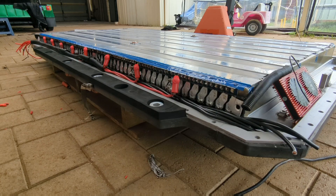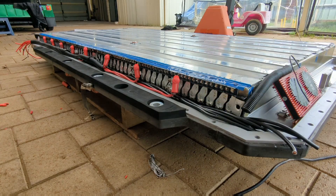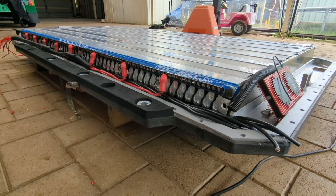I want to solder a link wire between this point here and this point here on each of the bus bars. I was going to try and put a fuse holder on this side so I actually fuse the length as it runs across the battery, but that's just not going to work for me — it's going to get too crowded on this side with all the fuse holders. By the time I put six fuse holders on each link it's just way too crowded, so I'm just going to put a link wire here and fuse it at the other end, and just hope the cells never get any internal shorts. Theoretically they shouldn't. I'm going to go through and tin all the nickel strips coming off the bus bars and then come through afterwards and solder wires onto them all.